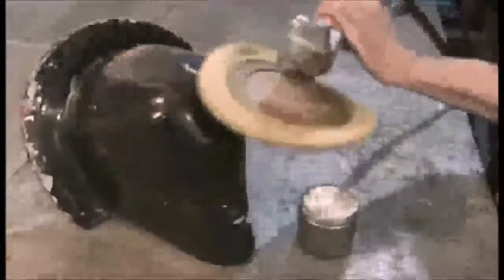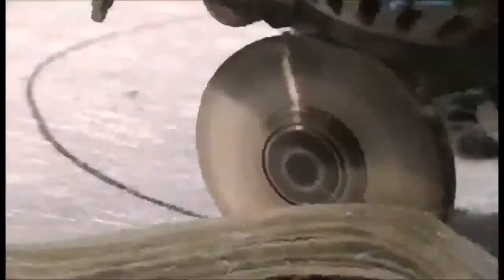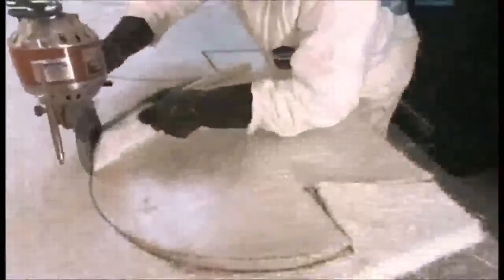After a black sealer is applied, it's polished smooth, eliminating imperfections that will be visible on the mold that will be made from it. Over at another station, fiberglass fabric is unrolled and cut into sheets, which are layered. A pattern is drawn on the top sheet. Spacing the shapes closely together minimizes waste. The goal is to create 100 masks from one roll of material. A disc cutter slices through 25 layers of the fiberglass fabric.